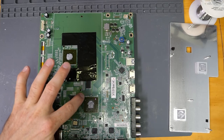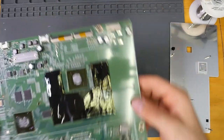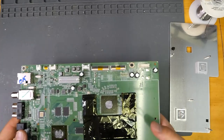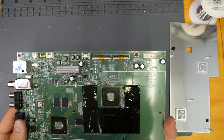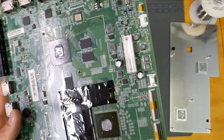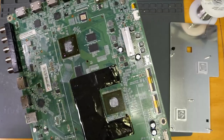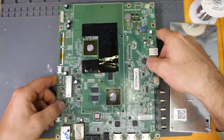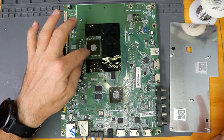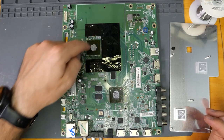I am seeing flux — signs of flux on the main processor chip. And looking at the LVDS BGA near the LVDS clips, that's going to be our video processor IC. It does actually have flux as well. So both chips were reflowed, which is a good sign. You do want to reflow both and not just one. Some services only reflow the main processor, which is typically the immediate issue, but we do often also see the video processing BGA chip fail, so it's important to reflow both.